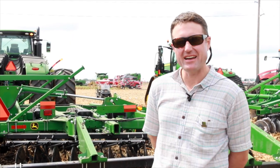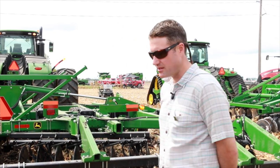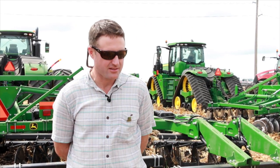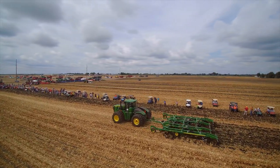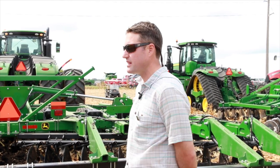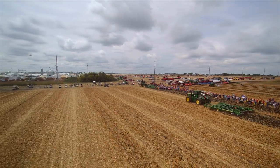This tool does not have the fine-tuning capability of the 2730 — it's more your set-it-and-forget-it sort of tillage tool. Just from my naked eye, general appearance, the soil profile between both of these tools looks pretty close today. That could have a lot to do with soil conditions — kind of a wet soil just with the amount of rain they've had at the show. But just to the naked eye, the residue looks to be the same size, and the color of the dirt turned over looks to be about the same.